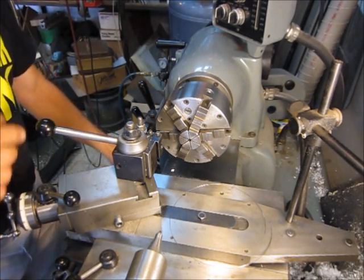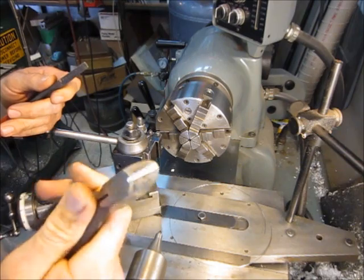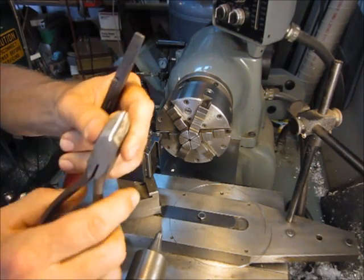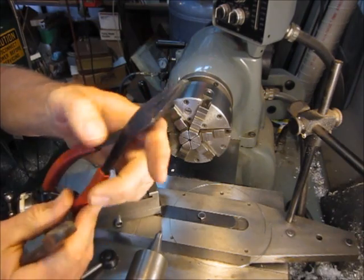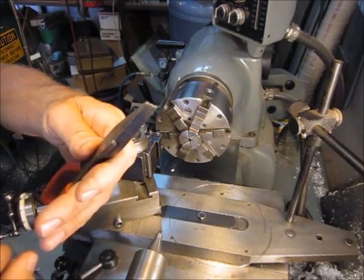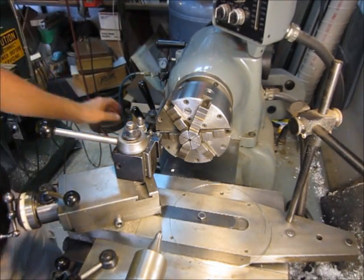Another thing you need when working with springs is a good pair of side cutters — sharp ones. You're cutting hard wire, so they'll do a good job if they're sharp. If you have something in your toolbox that's been kicking around for years and they're all dull, forget it — go buy a new pair. And another thing is a pair of duckbill pliers for forming the loops on the ends of the springs. These are really handy. I'll show you how to do that later.